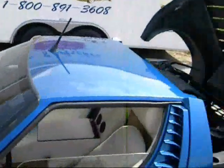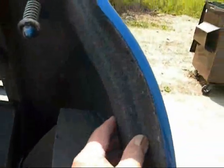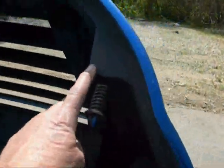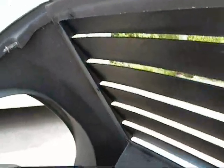Same thing in the rear clip. We did the same thing. There's a steel rib starting right down in here. There's a steel rib that goes all the way up here, and then we incorporate the latch mechanism into it, and it goes all the way around the back opening area, back window area, if you will. And then all the way down to the rear grill. Down in there, there's tubes above and below the grill opening there. And it's all hand fitted and bent to match the contour of what the body should be.